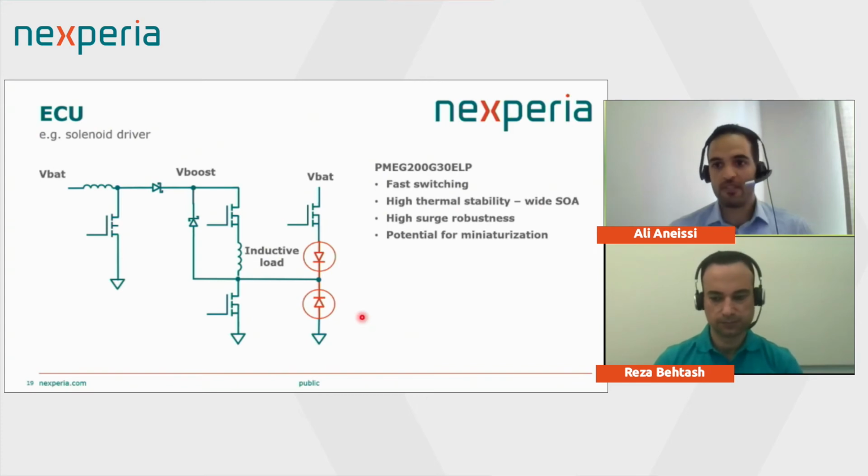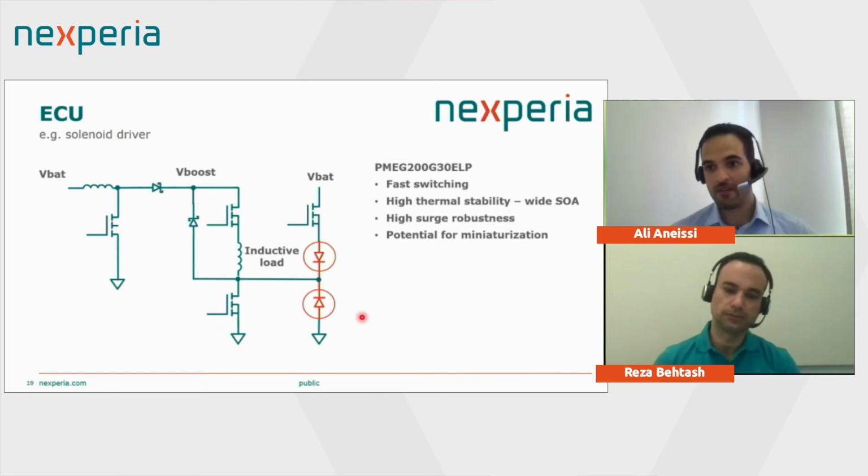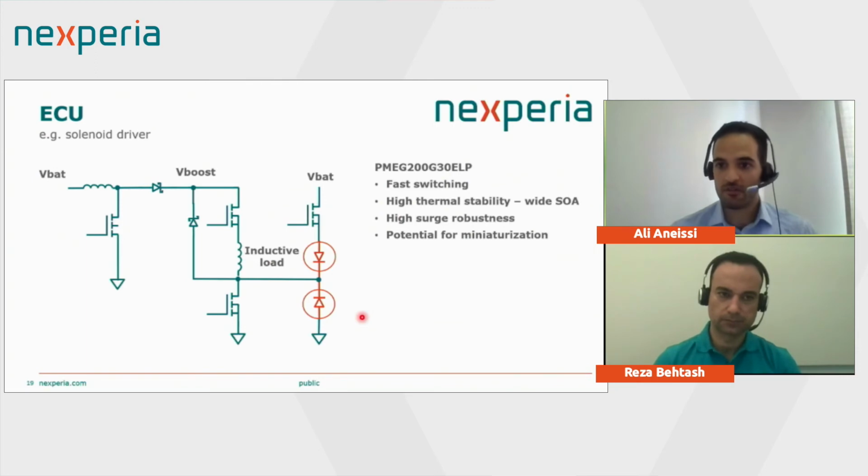So basically, if you see the comparison Schottky versus PN, you would pick PN for their leakage currents. This is one of the main reasons, I think, or one of the main weaknesses of Schottky. And I would say in that sense, this is where SiGe really cuts in, with the low leakage currents it could still provide while having a beneficial switching performance. And so any application where normally a PN would be picked, where the leakage currents are of high importance, is something where SiGe is also a considerable choice.